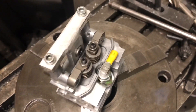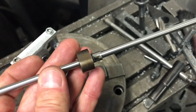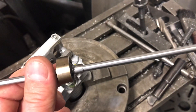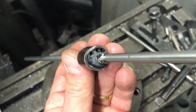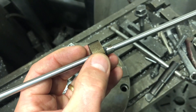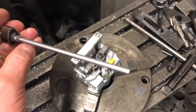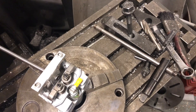I'm trying to keep this dimension across here as small as possible. The camshaft is this 6mm piece of rod or silver steel. I've drilled out the lobe, which is all I'm going to be using — got rid of the pulley, that was just plastic, so I've broken that off. I also need to drill through here for a grub screw to hold it to the shaft. It needs to be pretty tight, and that camshaft fits in right there.